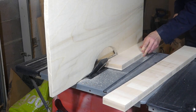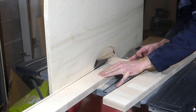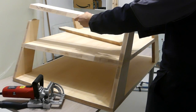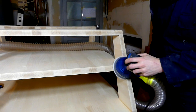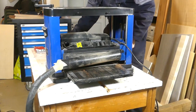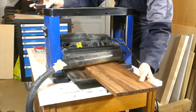I then did the same for the bottom of the table, glued everything and assembled the rest before sanding for a very long time to get everything nice and smooth. Now back to the island — I planed it down to get it nice and flat and sanded the result down using a random orbital sander.